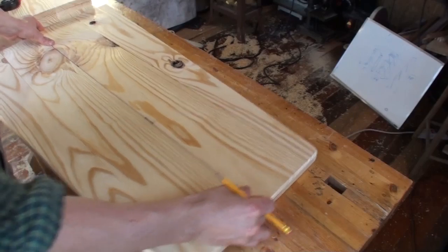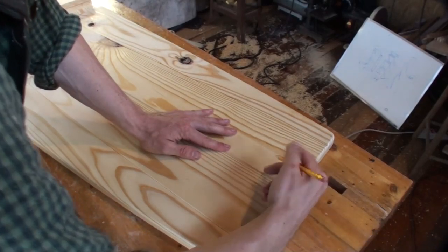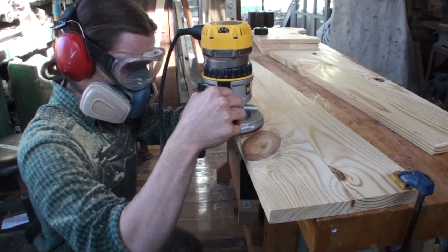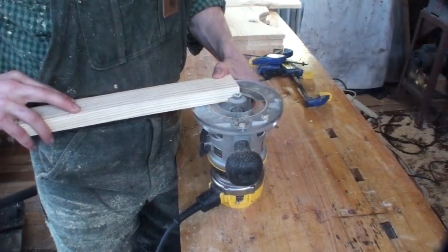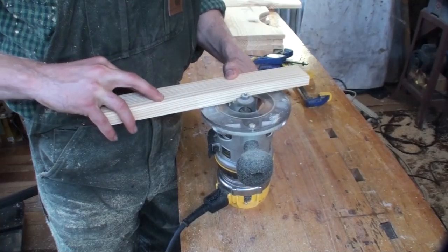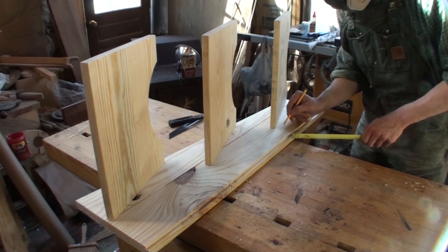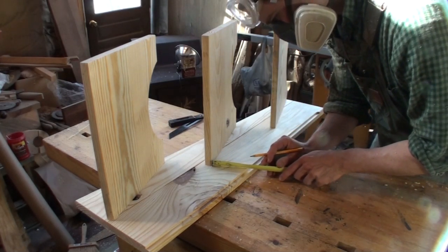This piece will make up a rail on the top rear of the rack. I then went on to transfer the mark from one panel to the other. Using a 3/8-inch rabbiting bit, I cut a groove that would accept a quarter-inch piece of plywood on the back of the rack. With the pieces balanced in position, I measured for the bottom part of the shelves that would catch the magazines. They measured 2½ inches, 3½ inches, and 4½ inches from top to bottom.